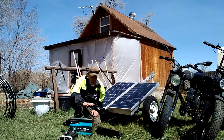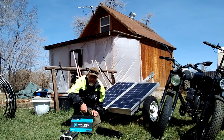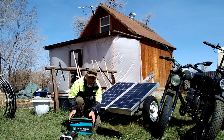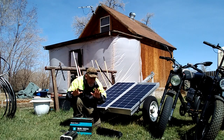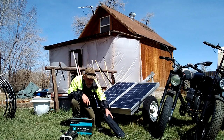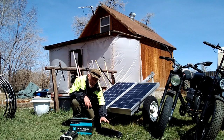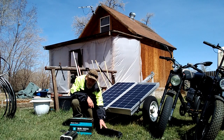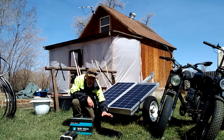These lithium iron phosphate batteries are extremely safe. I've seen demonstrations where they've been shot, dropped off buildings, and drilled through, and they simply will not catch fire or explode except under extreme situations. That is not necessarily true with the lithium batteries that come in your e-bikes. So when you're charging your e-bikes, make sure you're monitoring them the whole time. Don't leave them on the charger unattended. Unplug them as soon as they're charged.